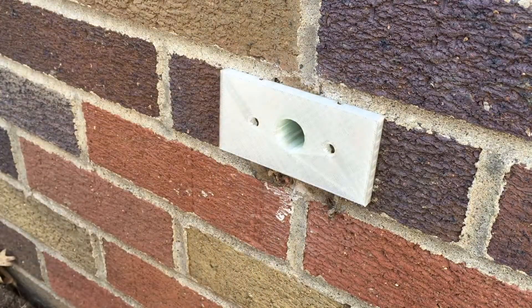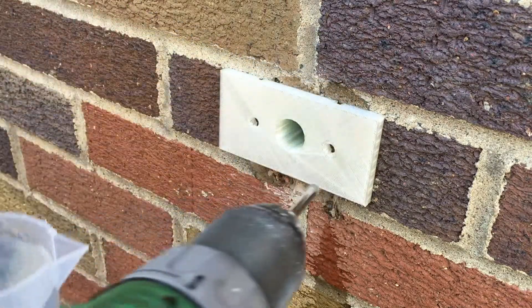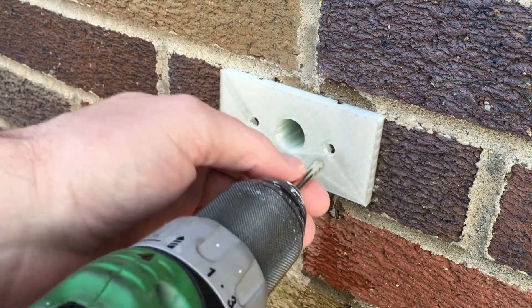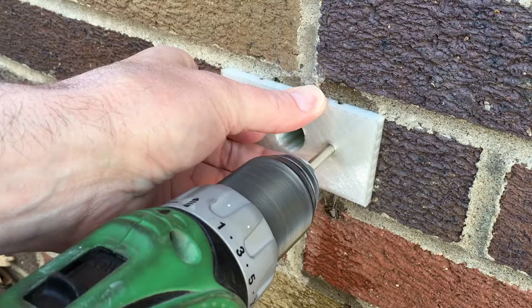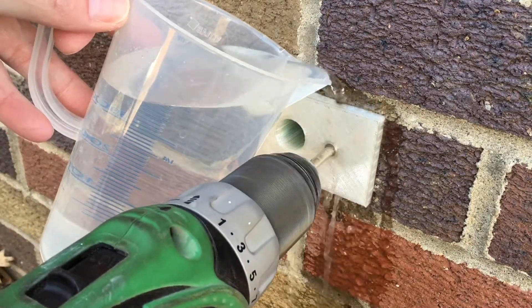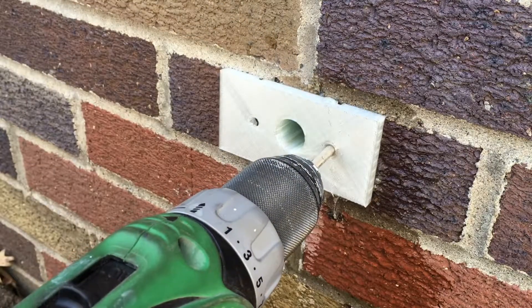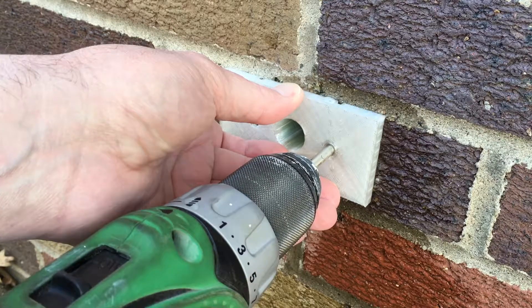So I have some water here to drizzle down there. I've got my drill. I'll start by putting some water down there. My plan is to kind of hold this with my hand while drilling. This could wander — it's not real flat behind here — so I need to hold everything as straight as I can. I'm going to go to the other side and start it. If I can score both sides I can at least continue it if this template moves or fails.